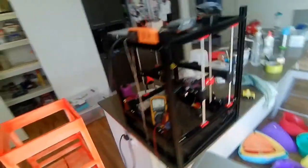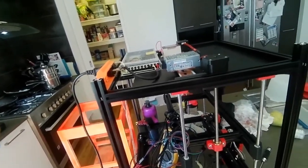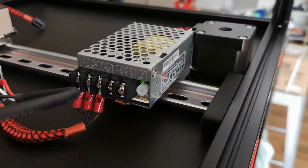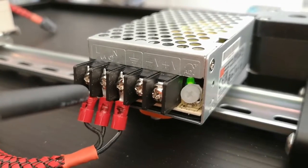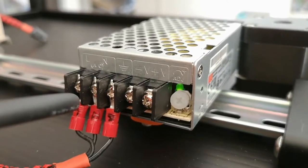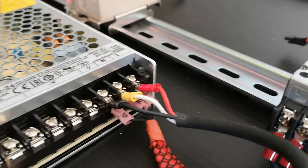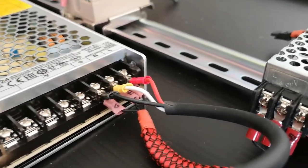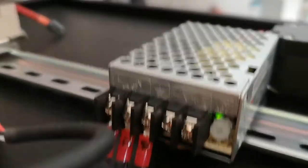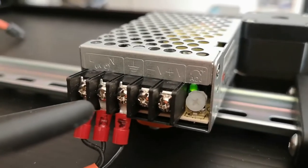The other thing I can do while I'm here too, now that I'm happy this is putting out power, is wire up this part. So I'll turn this off, adjust the voltage, and come back to it. Here is the wiring done for the 5 volt power supply. I've put them in upside down just so I've got a bit more room there. I've labelled them appropriately: ground, neutral, and line. I've connected it to the power here - you can see the ground. I need to still wire on the top the three pins for the eventual SSR and heated bed connection, so it's going to get a little bit crowded there. But we have power - you can see the green indicator. 24 volts, and this one is slightly moved up because the Raspberry Pi is a bit finicky - 5.08 volts, just a smidge above 5 volts. So we have power.